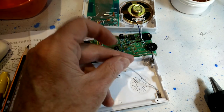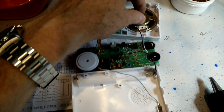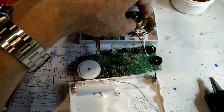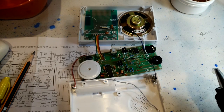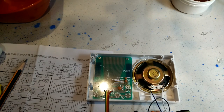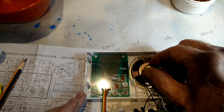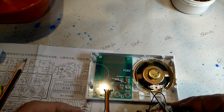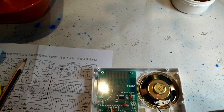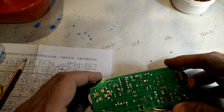Here's what I've got hooked up so far. I've got the speaker cables hooked up to the proper points on the board, I've got the power cable - ground and positive hooked up - and I've got the antenna wire ready to go. But I want to glue in the speaker first, since there's no provision for attaching it. I'm going to use a little bit of hot melt glue. Now I've got my speaker glued in there with hot melt and it seems reasonably secure.